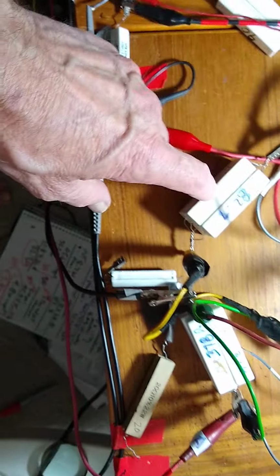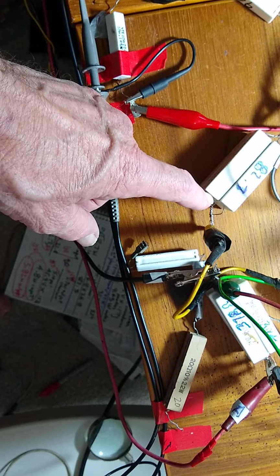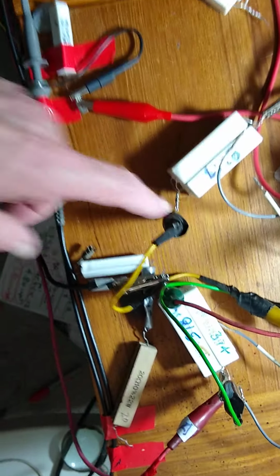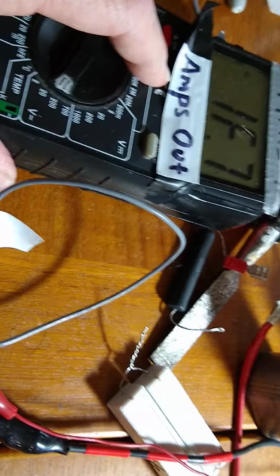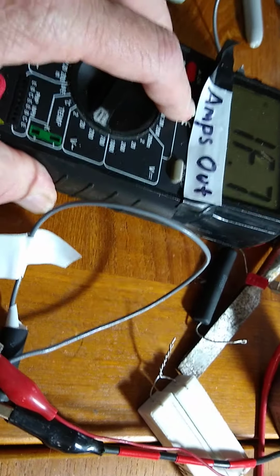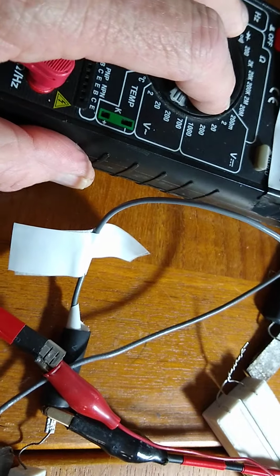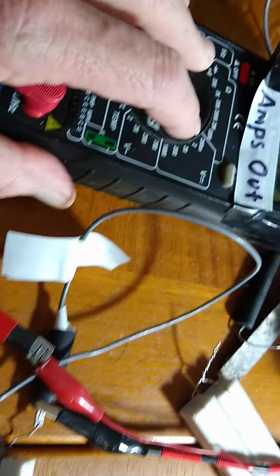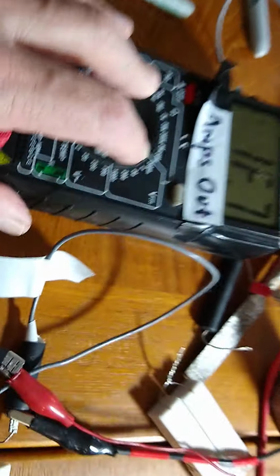Now, I did some tests last night, measuring the amperage going into a resistor. I think I was using a different resistor, but I wanted to correlate, see how bad this amp meter is. I noticed when it says 0.02 input, and you think you have really low input with the amp meter, if you use the scope and check what the amps is, it's really twice that. I think this meter cannot, at low, like 20 milliamps, 10 milliamps, give a good reading.